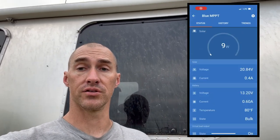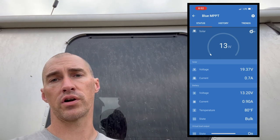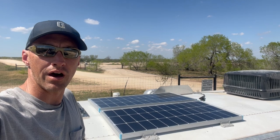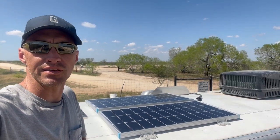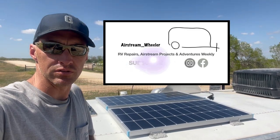I've got the connections made, the switch is on, and I'm seeing some wattage coming through the solar panels. It's not anywhere near the 200 watts that under optimal conditions we might see, given that it's fairly early in the morning and still pretty overcast. I expect we'll see better numbers this afternoon as the sun breaks through. Right now I'm happy that I'm seeing some wattage and everything seems hooked up correctly. The sun is high overhead and we're making about 150 watts right now. For panels that aren't angled toward the sun I think that's pretty good, and this is well worth the investment. It's going to support our batteries a lot better than the previous single panel.